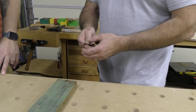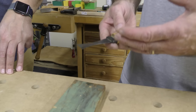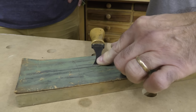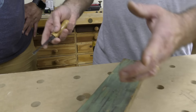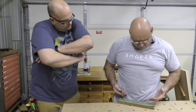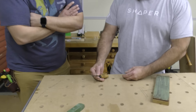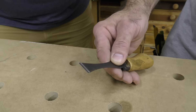If I have a chisel like this and it's not dull but just not cutting perfectly, I'll do a quick lap on the back. That's actually a very fine grit, and what it's doing is bringing it up to the best sharpness. I strop close to myself, feel that bevel, drag it back — a couple of quick passes and it's back up and running perfectly, super shiny.